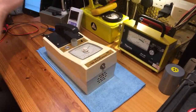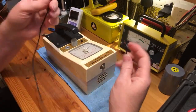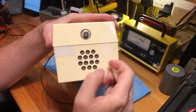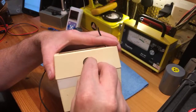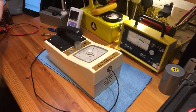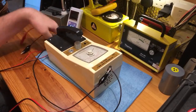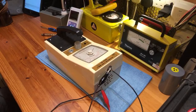If you wanted to do it the really cheap way, on the PET-100 cable the centre pin is positive and the outer screw thread is negative. So with a little piece of thin cable, you can put that in there, clip on to the external part, connect that up — and that's our connection made.